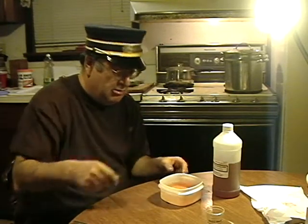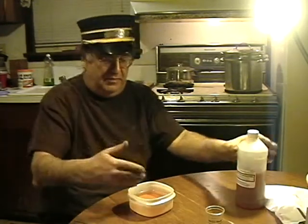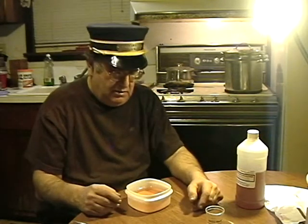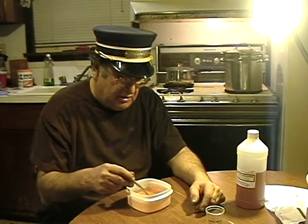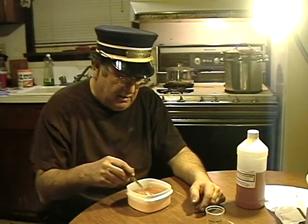Put the plate in — just drop it in there and let it sit for a couple of minutes and you'll see it start to come up. Then you take the clean acid brush and you just start to brush it very lightly on the top, and it'll start to develop. It'll take away all of the resist that you don't want there — that's where you want the ferric chloride to etch in.